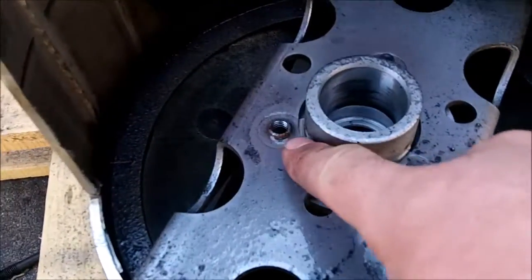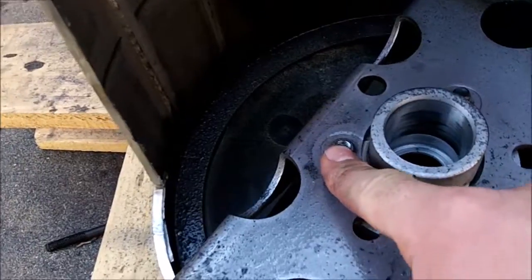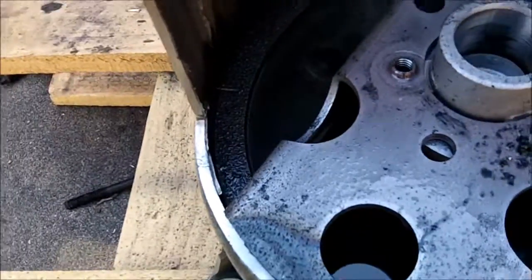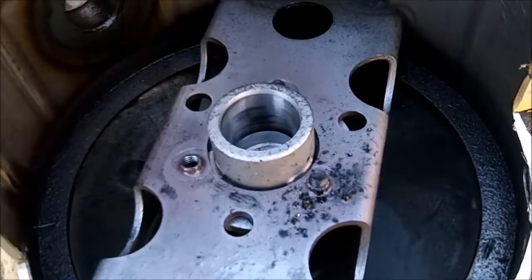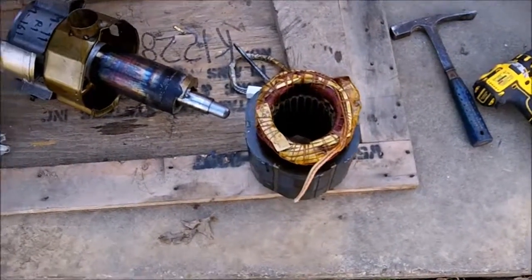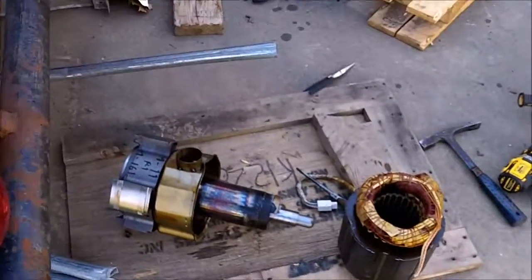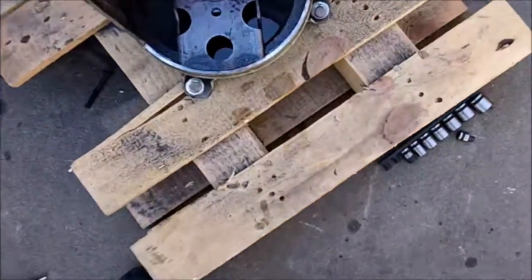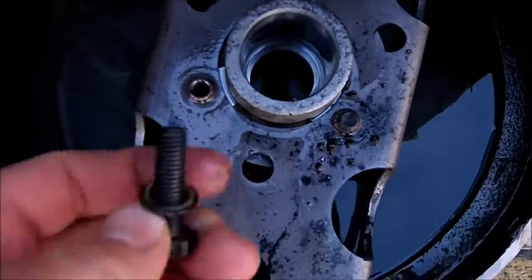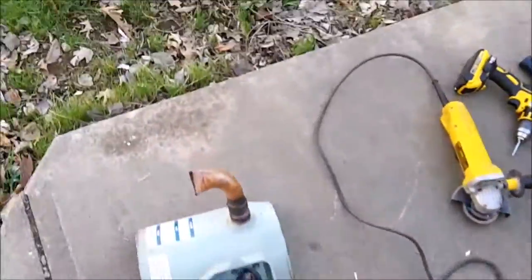Here you can also see one of the other problems with it. See, there are these three screws holding it in, and one of the screws has vibrated out — I did not remove that. It's floating in the bottom, which I'll remove and show you. I got the stator removed off the rest of the assembly. Here is the small screw that vibrated out of the bottom main bearing, which would go in right here from the bottom. So that's one of the failures. It didn't really cause any problems, but it shouldn't be like that.